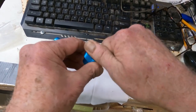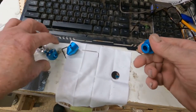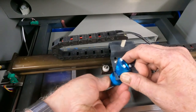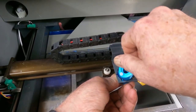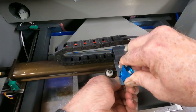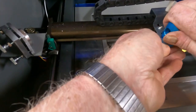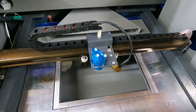We're going to screw this piece on because it's going to keep the laser lens in place. Leave the nozzle off because it's going to get in the way when you go to put this thing back on. I prefer to screw the head on — there's a large hole right here that you're going to be putting this thing in. Once you get it centered, tighten up the bottom. It doesn't need to be super tight, just tight enough where it's not going to move on you.